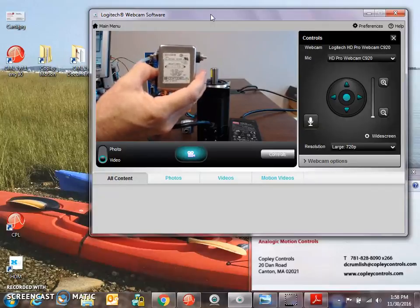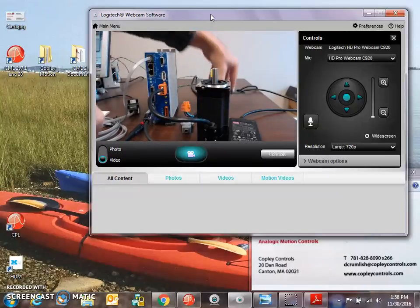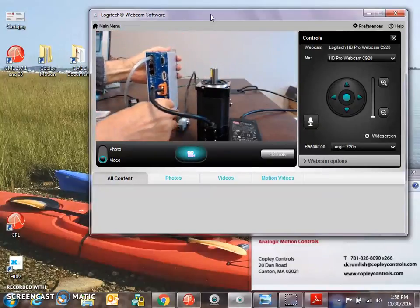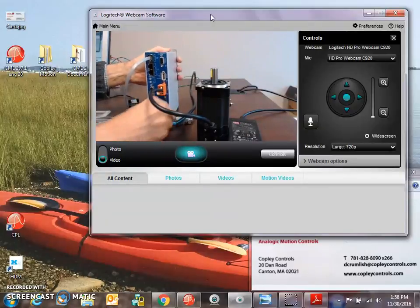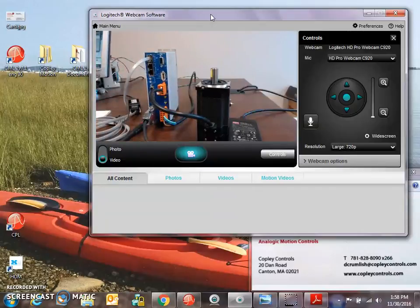Yes, a line filter. Here's a good one. Corcom. Other people make them. This is for emissions. It is a PWM amplifier. It's a quiet amplifier, so there's not a lot of noise, but the standards demand filtration, so there it is.